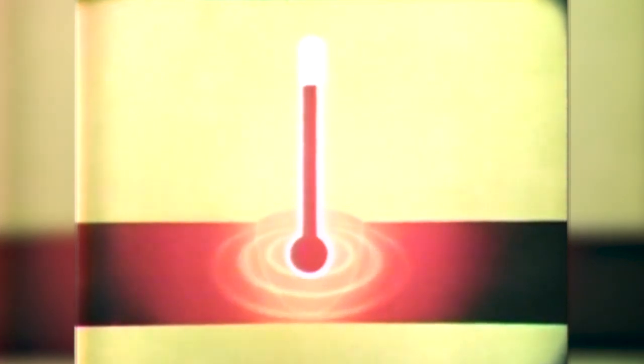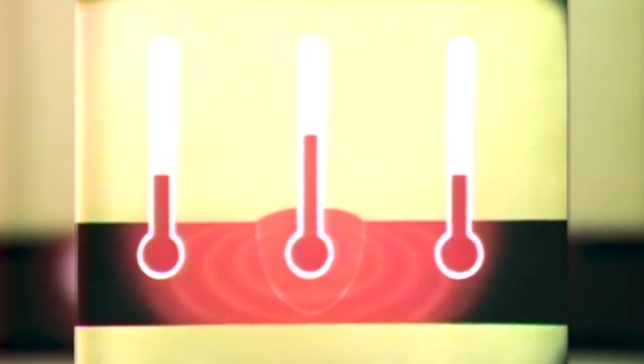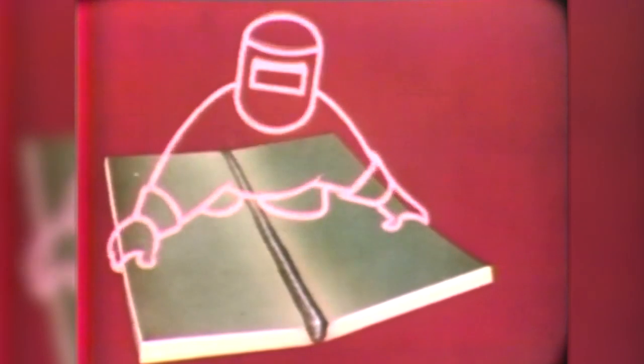Looking at the end view, we can see that the intense heat of this molten weld metal, plus the heat of the arc itself, is being transmitted to the surrounding areas. It is important to understand that while the weld metal is cooling and therefore contracting, the temperature of the surrounding plates is rising, and therefore causing considerable uneven expansion. As these plates cool, they will also contract. When we allow expansion and contraction to occur without any control, the result is bound to be distortion, caused by this tough-looking villain, Mr. Shrink himself.